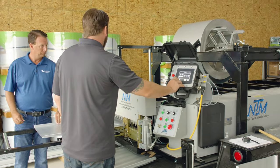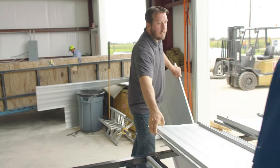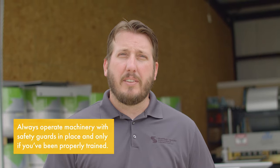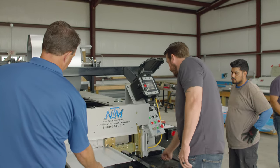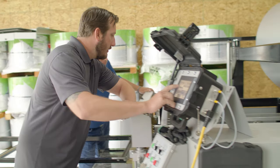The SSH machine is in between the SSR machine and the SSQ machine, right in the middle. It does residential metal roof panels as well as light commercial metal roof panels. It is upgraded from the SSR machine because it does have a hydraulic guillotine and also has a batch computer where you can automatically run panels out and set and determine different lengths and things like that.